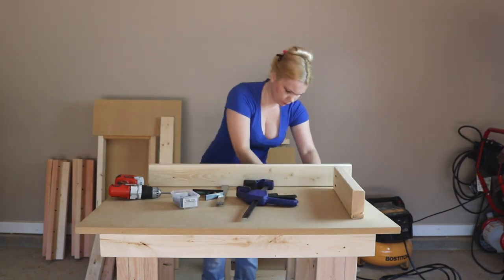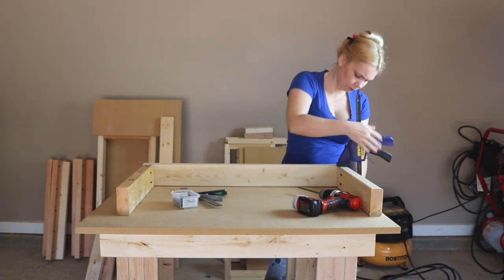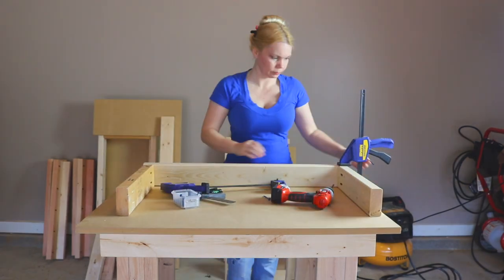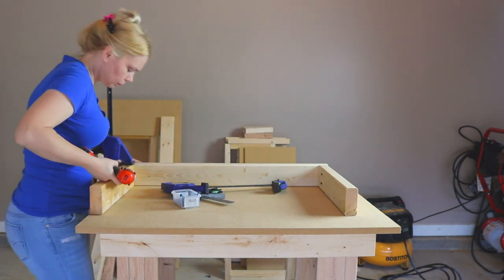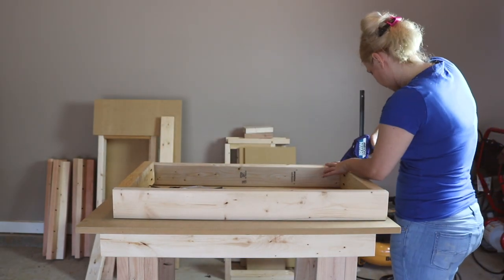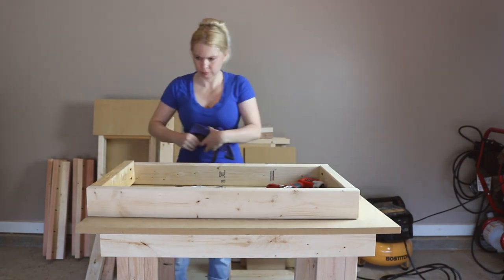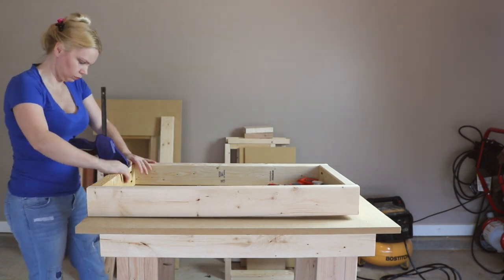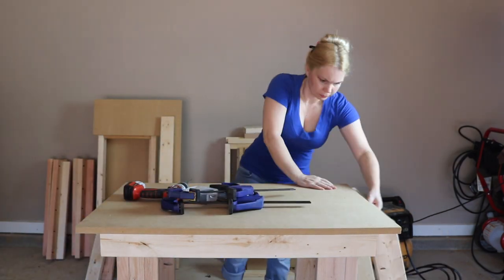For the frames, I did a simple butt joint, again using the pocket hole screws to join the sections. For this to work properly with the hardware that I'm using, I need my frame to measure exactly 4 by 4 inches smaller than my table top. Since I want my finished work area to measure 36 by 24 inches, that means my frame needs to measure 32 by 20 inches once assembled. This will leave me with a 2 inch overhang on all four sides. If you want more specifics on the measurements, you can go over to my blog — I will leave a link below in the description.